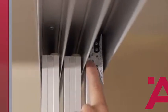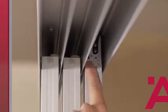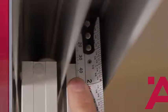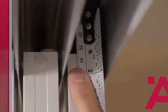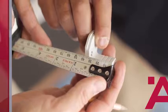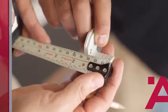The first thing to do when installing soft-close triggers is identify the height of the door to the underside of the sill. As you can see, we have a measurement of close to 35 millimeters of gap above the door to the underside of the top track. We measured the distance between the upper part of the door to the underside of the top track to be 35 millimeters.